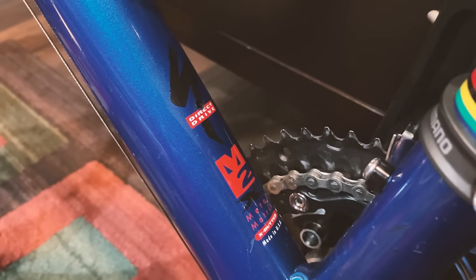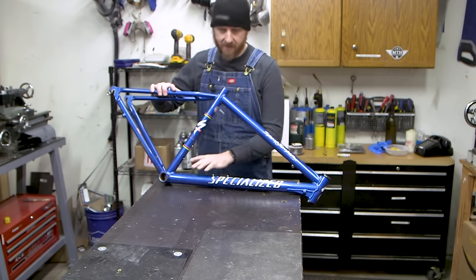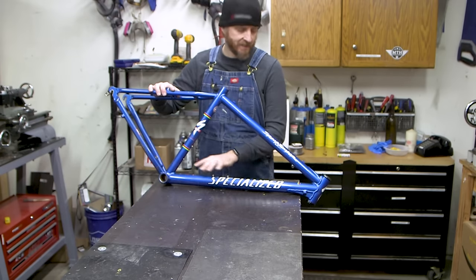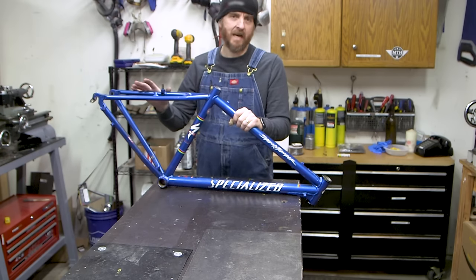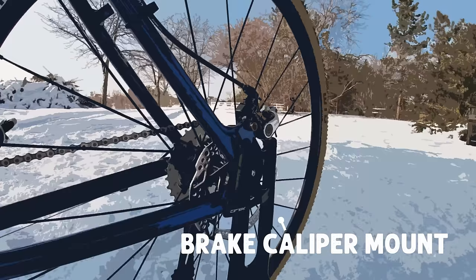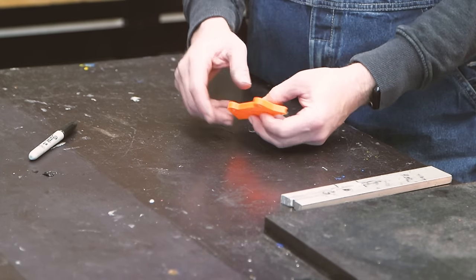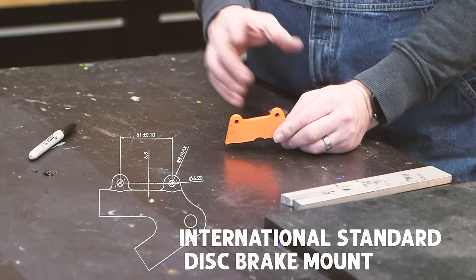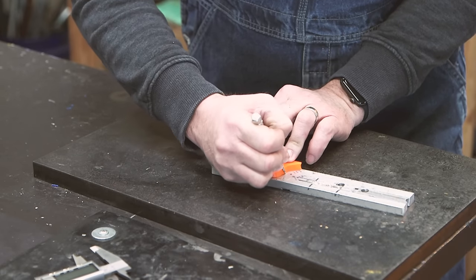If you hold them next to each other, they're nearly identical. I really like this style of frame — I always thought they looked nice and I like the paint on it. The only downside is that it doesn't have any way to attach a disc brake, so the first thing I want to do is make a mount for a disc brake caliper and braze it to this frame. I drew up several iterations in SolidWorks and printed them out — this is the one that fit the best. I'm going to use an ISO mount so I can install a post mount or a flat mount using appropriate adapters.